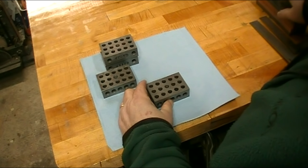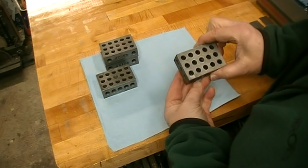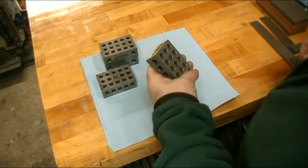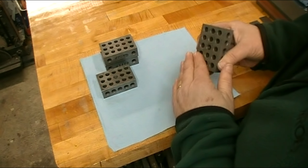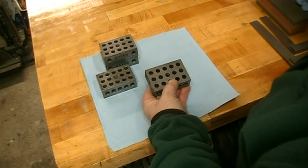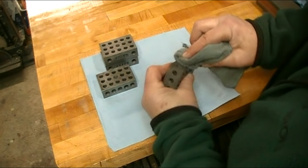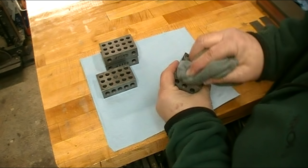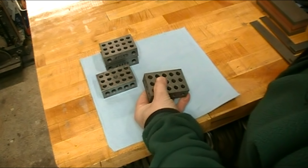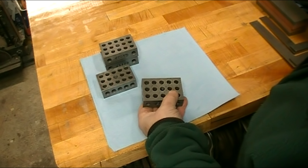One of the primary uses of precision ground flat stones is to stone off precision surfaces. I already showed you I de-rusted these — there was a little bit of rust and they cleaned up okay. The other thing I did was use acetone to clean them off and make sure all oil is off them, because oil, grease, and dirt will load up the stones. I'll use either rubbing alcohol or acetone; since I'm out of alcohol right now, acetone is the thing.